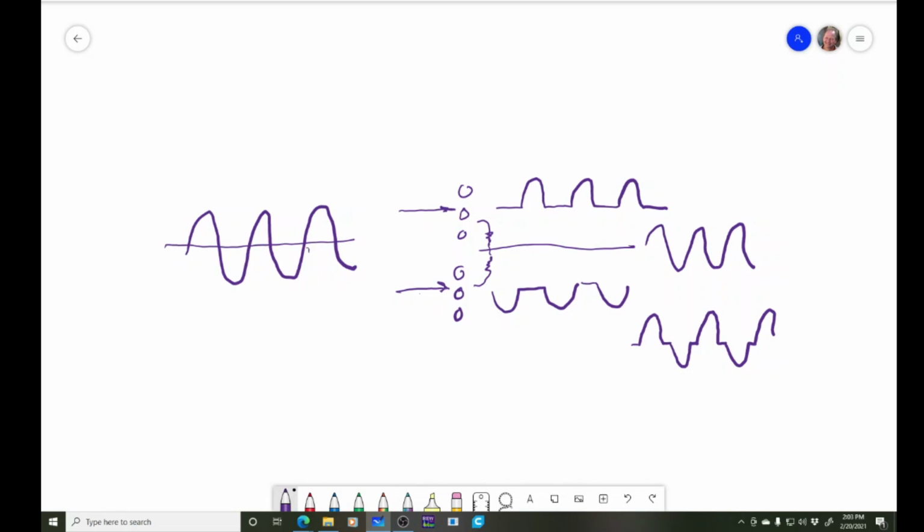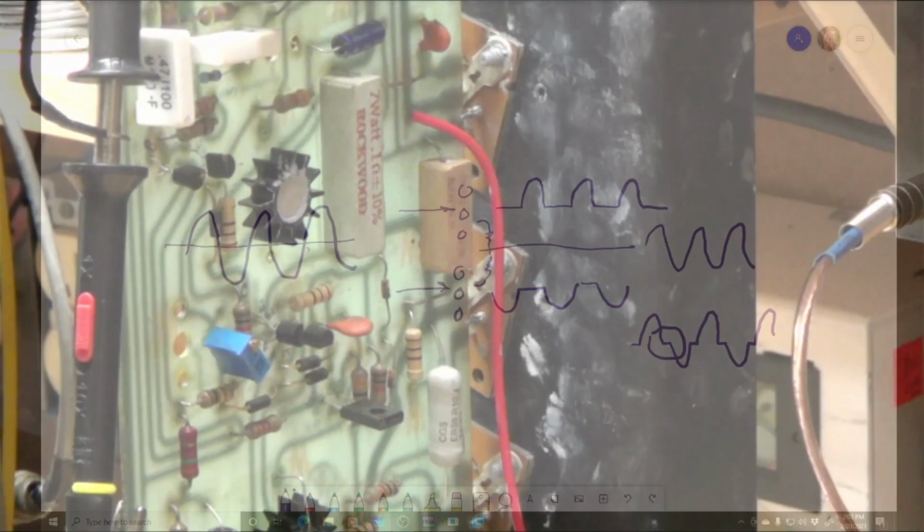And the thing that's bad about this crossover here is that it's almost a little bit like a square wave, and square waves are made of third order harmonics, and third order harmonics sound harsh, so you really want to fix this, and you want to get it so it just gets right, but it doesn't do overkill either, because if you go too far in your adjustment, it can make the amp work harder. So let's take a look at that.